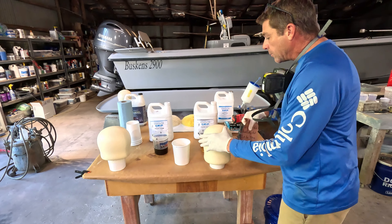You can kind of just slush that around a little bit. Again, boats under 21 are required to have foam by the Coast Guard. The foam can and does add strength, and yes, it can soak some water over time if it's not sealed or encapsulated properly. So just like about anything in life, there are pros and cons. The B part is generally kind of a lighter honey color. The A tends to be darker in nature.